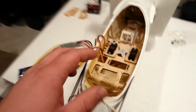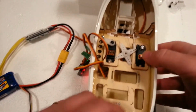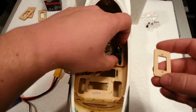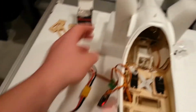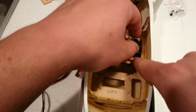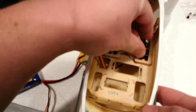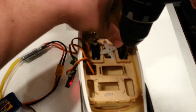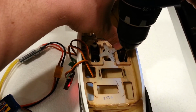I can either try to screw in one side, force it over, because you see how we got a little play there. These servos are not always exactly the same size, you know, so in this case, if we pick a position like that, that gives me a full bite in the back, and then we're forcing it back to one position in the front. But I can still grab a little bit of material here. So you just have to make that tough call.